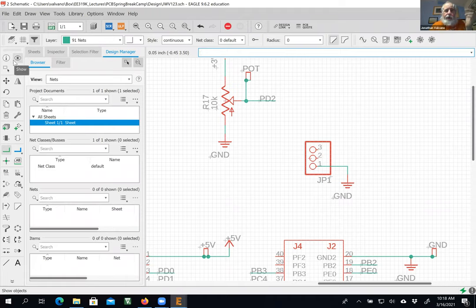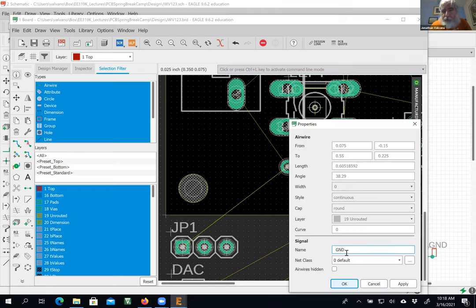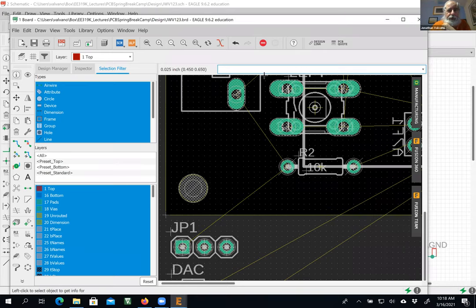And then I'm gonna go over and make sure it's the square one that is ground. Yeah, you see the square one here. You remember what these yellow lines are? The net list. The net list was a good answer. The fancy name is it's a rat's nest. It represents connections that need to be made. Okay, so you can actually do an info on it and see that that is a ground net, okay? And it's called an air wire, okay? An air wire means you haven't connected it up yet, okay? All right, save, switch, save.